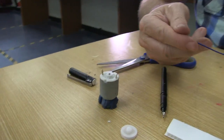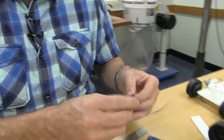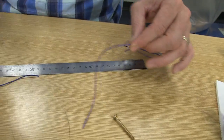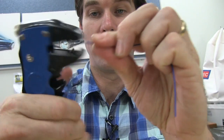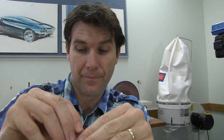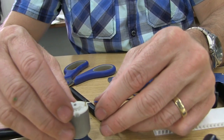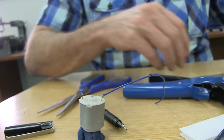Let's put on our motor. Here's some wire — we need to cut that and attach it to the electrical connectors of our motor. Take the wire and measure 150mm. Take the wire strippers and cut it. We need two of those, so repeat that process twice. Strip off around about 10mm from each piece so you can see the wire. Twist those together, take them over to your motor, feed them into the hole, bend it over and wrap it around. Do the same to the other side.